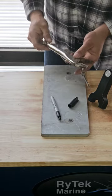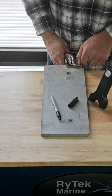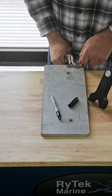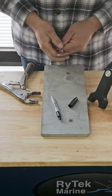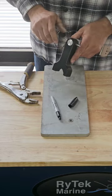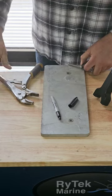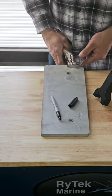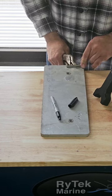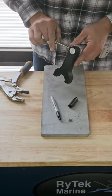That was too light — it didn't even do anything, so I'm going to tighten the vice grips a little bit. Less is better on this — it's trial and error. You don't want to do too much; if you over-bend it, you can bend it back with a hammer, no problem. I can start to see a little bit of a tweak in it. I do this basically every single time I put a mount together, so if you're buying a connecting rod separately, this is what you may want to do.